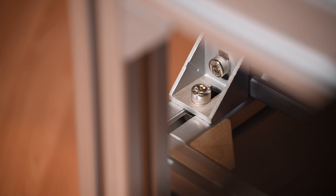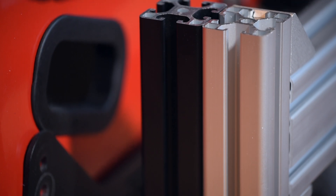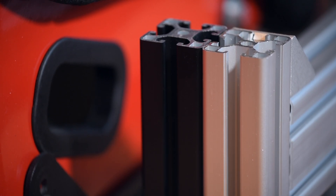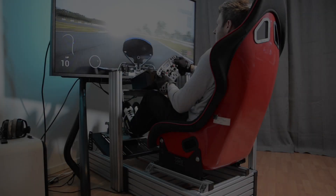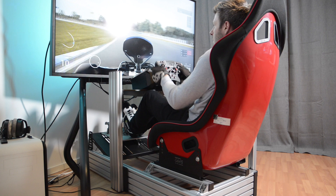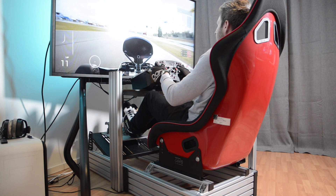Glitter problems aside, there are a few things I noticed when comparing the GT Omega parts to leftovers from an earlier SimLab order. Let's start with the most obvious one: comparing the cross-section of the profiles reveals that there's just a lot more material in the SimLab parts. On 40x40 pieces, the SimLab is a whopping 52% heavier per unit length, so it looks like there's some cost-cutting going on at GT Omega. But is that really a bad thing? I'm going to go ahead and say no — and also yes and no. No, because I wasn't able to make out any flex within the profiles themselves.